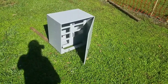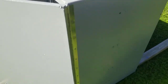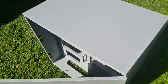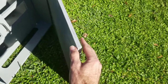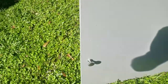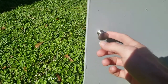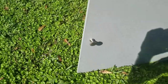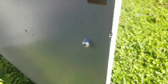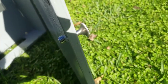Now that all the paint's dry, I got some of the hardware put on the box. I have a piano hinge that runs the entire length of the side here — that gives the door some support. The thickness of this door is a half inch. I got an inexpensive cabinet knob from Lowe's, about a dollar and a half. Now the screws that come with it are mainly made for three-quarter-inch cabinet depth, so what I had to do is stack some washers behind the screw head so that the knob was flush against the door.